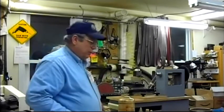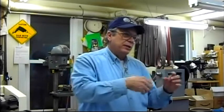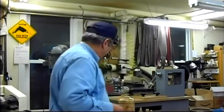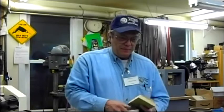But anyhow, the Society of Ornamental Turners, they've been keeping minutes of all their meetings since 1948. I think even before that. I've got all their bulletins. And what I wanted to do was make a butterfly using a rose engine. So you should be able to make a template to do that. I thought all you've got to do is draw a butterfly, expand it out, and it would work. It doesn't work. And in fact, you learn why after you figure out the reasoning. But I did it, after I read one of their bulletins. That's the template.